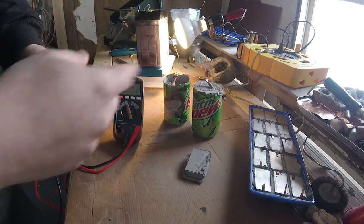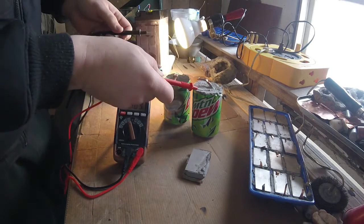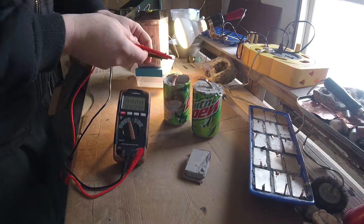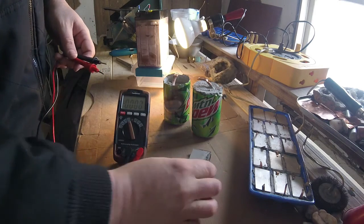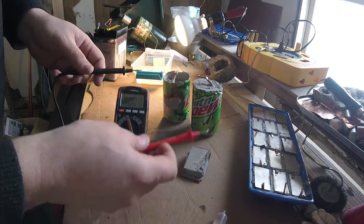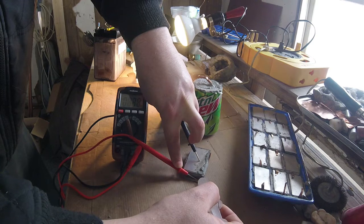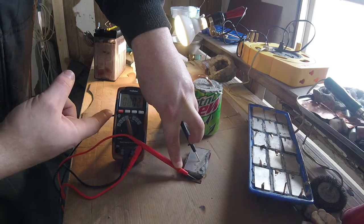It's been a month since I've gotten back to this experiment. It's still 1.1 volts out of this one — this is the pure cement. This one's a little less. I put a mixture of stuff in this one. This one's even less — this held a volt before, and that's probably because the plates are coming apart. I bet if I put water on it, it'll increase in voltage right away. So I have a little bit of distilled water — just watch, it will connect with these plates better and increase in voltage. We have .084 right now.